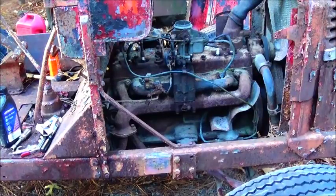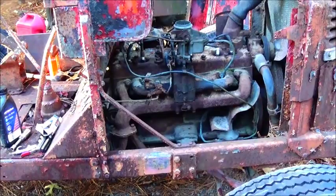But like I said, we may end up having to pull it off, but I'm gonna keep trying to let it soak a little while, trying to get everything freed up and get some of that carbon and stuff out of it. If we can ever get it started, I think it'll be fine. People think it should have started, or that I should pour more gas in it. The problem is, like I said, we're low on compression.